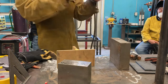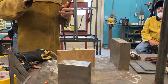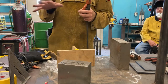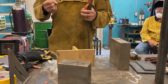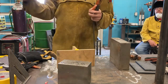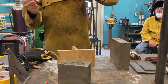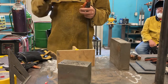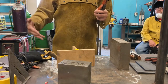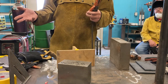Always adjust the work to fit you. It should never be a case where you are adjusting your body to the work. That leads to injury. Never. Always adjust the work to fit you. Whatever you gotta do, you gotta get a ladder, get a step stool, raise the work up, build a platform to get to it. Always do that. Never put yourself into a position where you've got to overextend your body or get into a weird position, because it may be okay for the moment, but over a long work life these things will cause chronic, irreversible injury. And if you can't work, we can't make money. So we always got to keep that in mind.